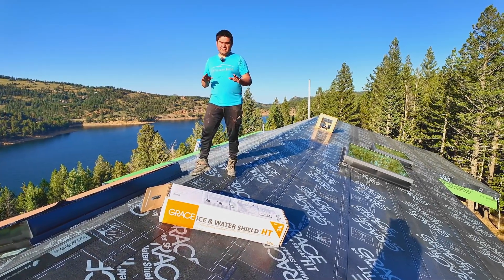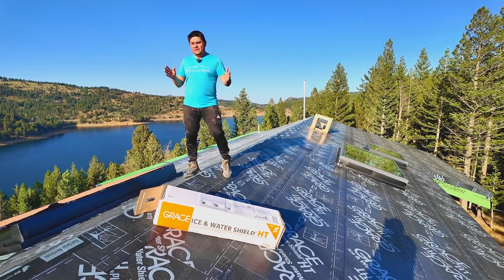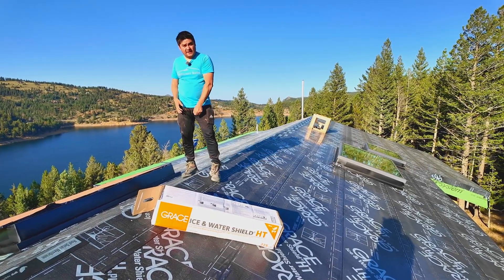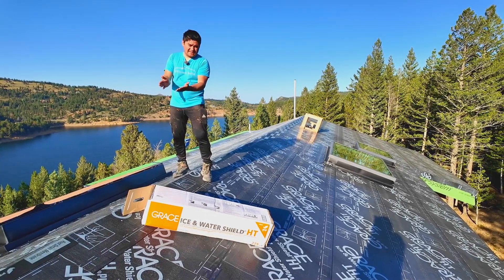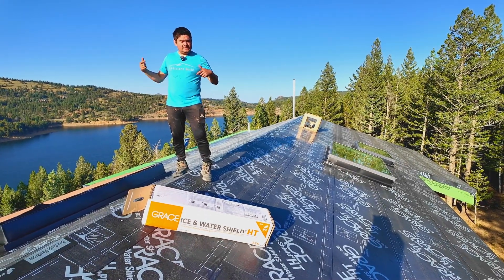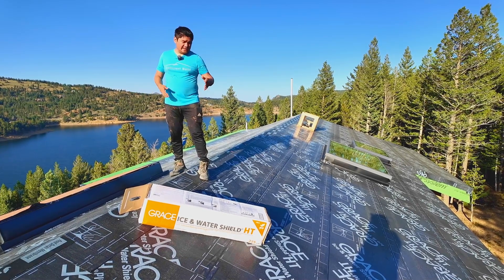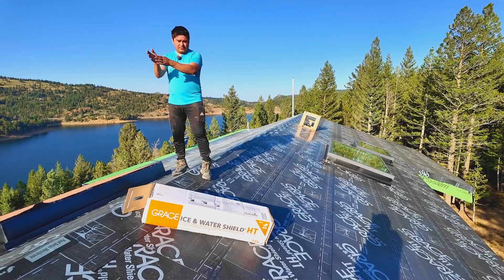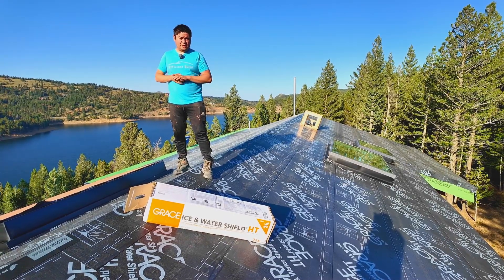Their name is SunStyle — if you want to look up pictures on Instagram. When we install that, we're going to run a knife here through the ridge and then install a ridge cap, which is aesthetic but also allows us to ventilate the cavity we have for our exterior insulation. Should any water get in there, it can evaporate through the ridge cap. I really hope no water gets in there, but water is very tough.